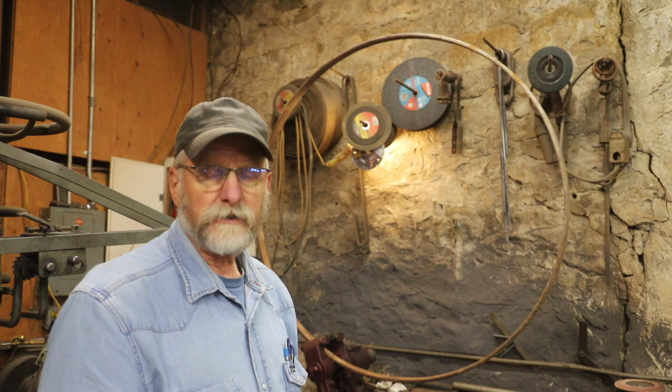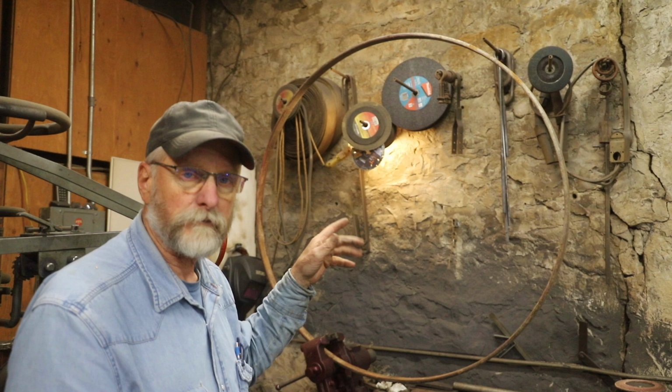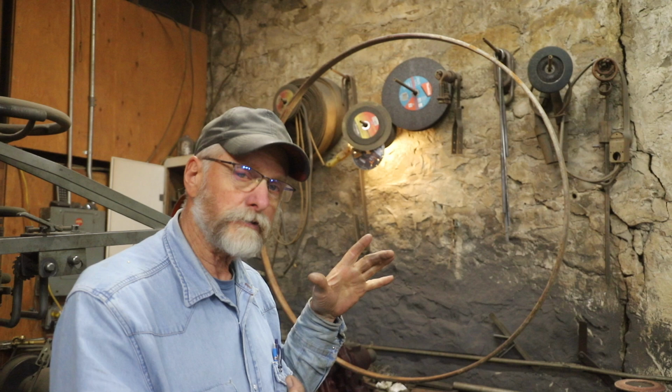On sizing this tire, I actually sanded this wheel down to match the circumference of the tire. Now I want the wheel to be 0.2% larger OD on the wood than the tire, so I have that measurement to where I want it.